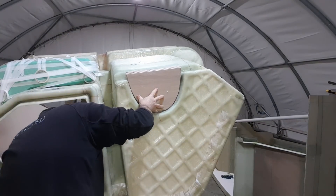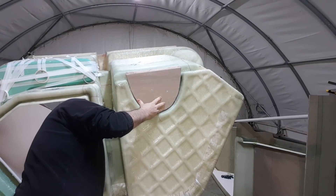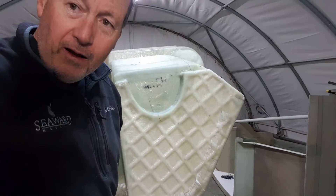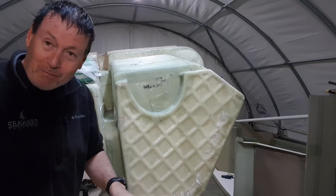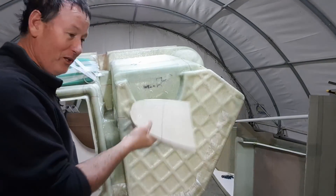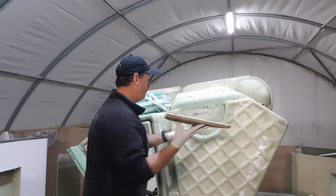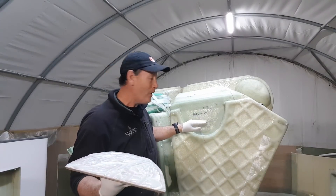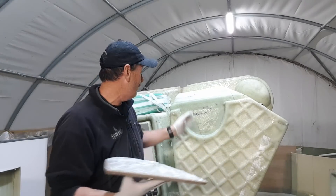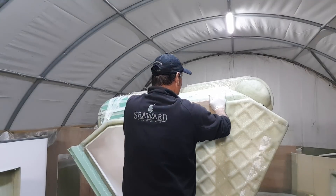That was an effort — it's like working through a bloody mail slot. I need to remember to take the peel ply off. All the material I'm actually bonding this to is still green — I only laminated this yesterday — so that's another chemical bond on top of the physical bond from all the epoxy. I'm going to slather this with epoxy, glue it in place, screw it in and go in for a beer. I've had a gutful today — I'm absolutely cactus.